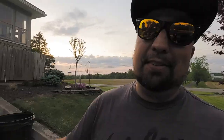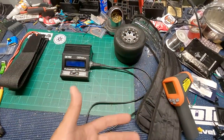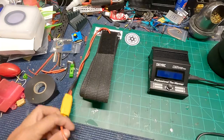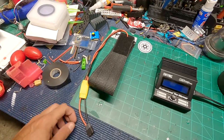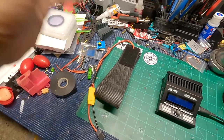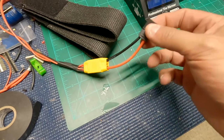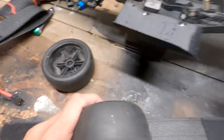I've got something that is really hot — let's check it out. In the last video we talked about the SkyRC unit, which works great honestly, but I've got a belt that goes in and out and sometimes it works, sometimes it doesn't. So I was looking for another solution, and this was pretty much one of the only ones I could find. These are from Desert Hobbies and it's a direct plug-in to a 3S battery — they just basically run, there's no temperature control or anything like that. They do come with an XT90 installed, and I just went ahead and made a converter to XT60 so I can use any of my 3S batteries.